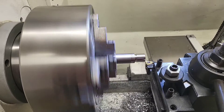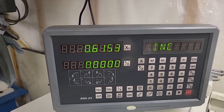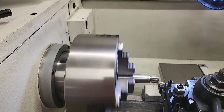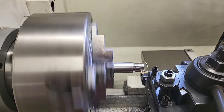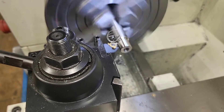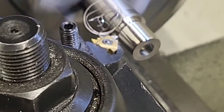We're at .625 diameter for our starting pass and we're going to take .010. So we're at .615, at our zero start point and ready to go. Waiting for number one on the threading dial to come around — here it comes — and we're in. There's our first pass, stopping in the undercut. Let me zoom in — there it is, that's our first pass.